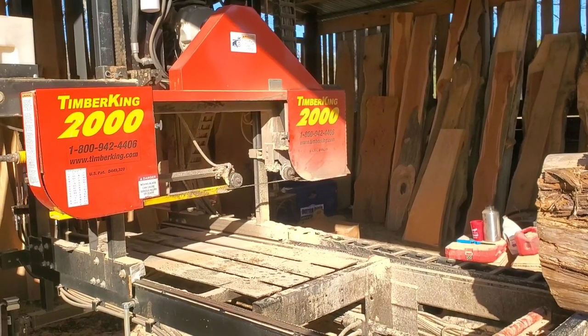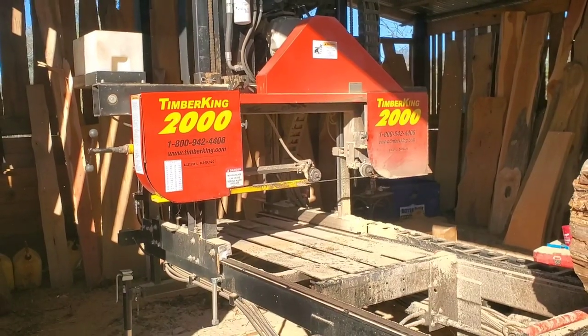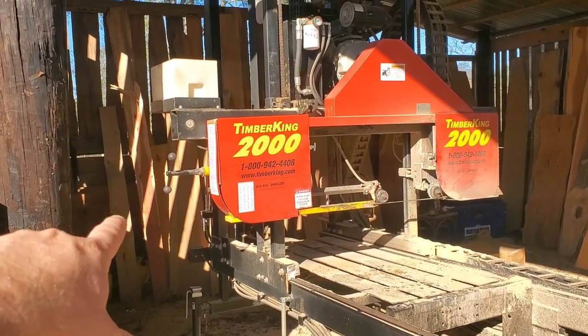Measure off the deck at your lowest position, and then you want to make sure your lowest position is 1 inch, unless you want to cut something less. But then you go ahead and set home on the computer.